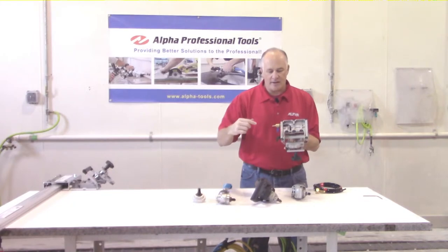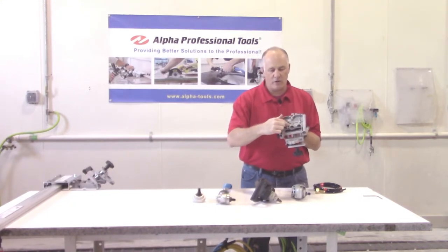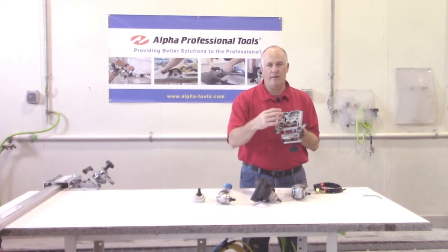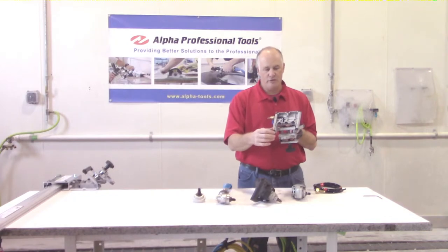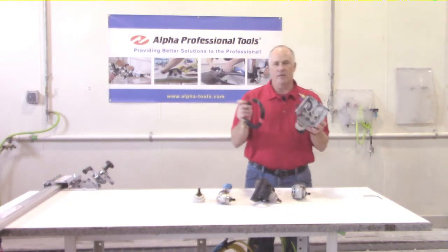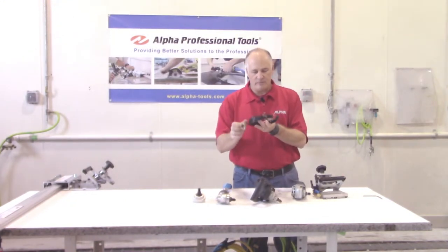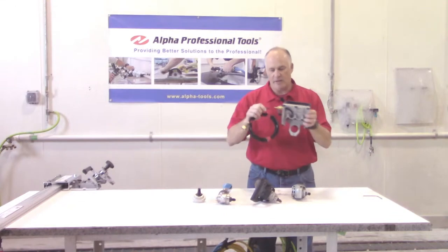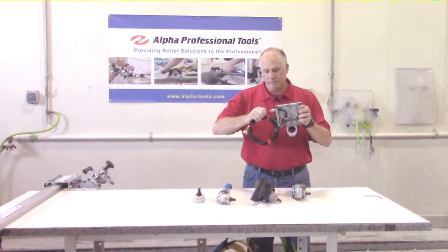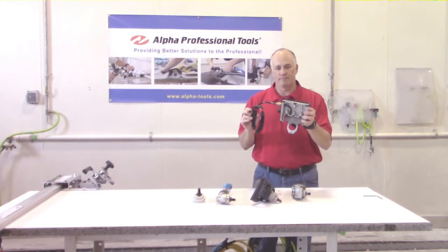And when a hose is connected, the water goes through the unit through the black hose, and the water sprays onto the spindle and the abrasive that we're using. What we do, we take the hose with the garden hose connection. This will be inserted onto the water cock, and this will provide your external water fed system.